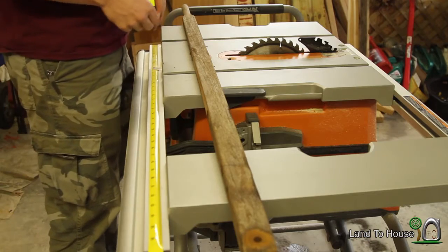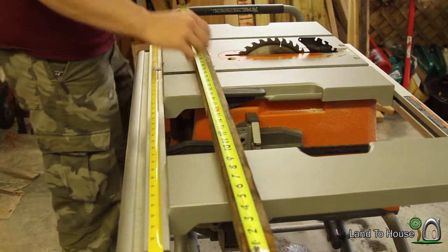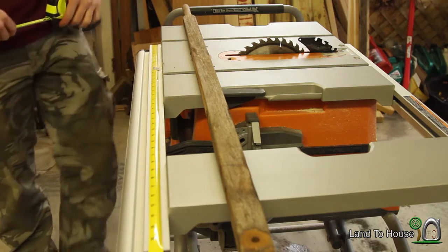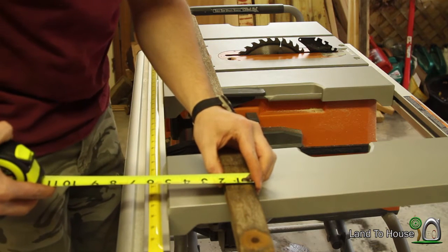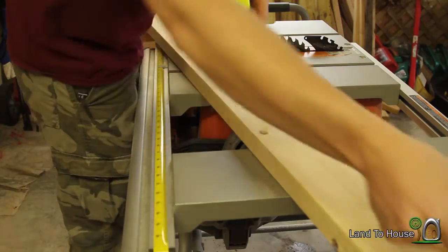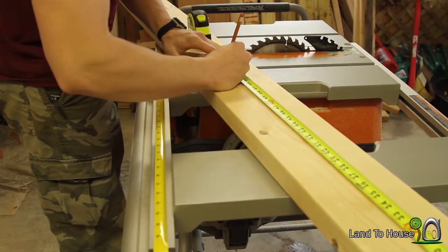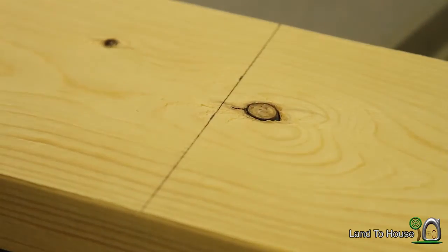Let's take a look at the wood that came off as the handle. It's 56 inches — so that's what we'll need to cut for the length. And we've got one and three-fourths inch for the width. So on our new board I'm going to measure out 56 inches, and use a speed square to make sure it's going to be a 90-degree angle. Now let's cut this in half.